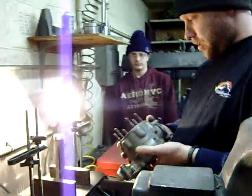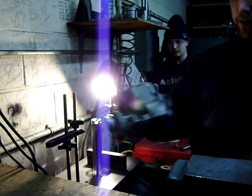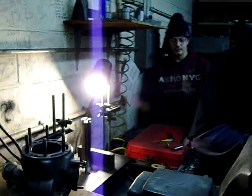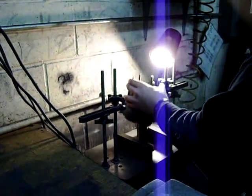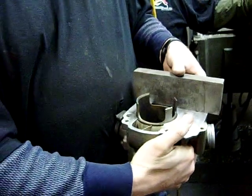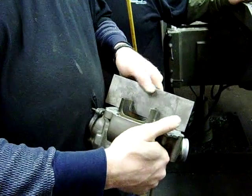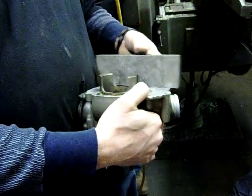You want to make sure your parallels are good and straight — that everything on these is square. These surfaces need to be square and straight, and everything is the same height between the two so that your blocks are dead on. It's easier to show upside down: I'm going to be dropping the cylinder with this side down. You want to set it so you get good contact — on this particular cylinder, you've got a nice big area of face to touch. Make sure you don't get it in there cockeyed or off center. You want to make sure you're on the bottom surface.